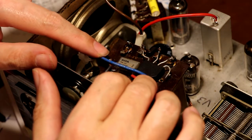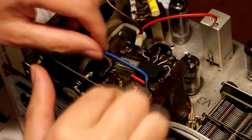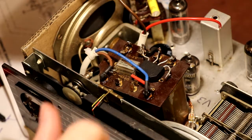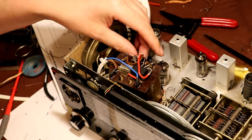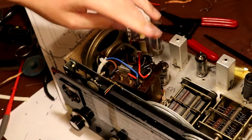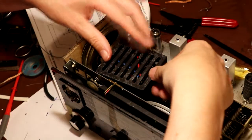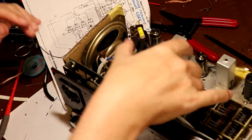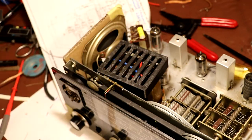I also thought we were getting a hint of modulation hum and maybe RF instability. This radio would have had an RF bypass capacitor fitted across the main supply - well it didn't when we got to it, but I've fitted one of these X-rated safety capacitors, so that's got one installed now. It probably won't make any difference but it's shown on the diagram so we've put one in. It's a bit of a rat's nest in here. I was also getting a little bit bored with shocking myself on the top of this transformer, so we've just gone ahead and 3D printed a cover which should just clip onto here. It's got a little notch cut out of one side just to let the pulley wheel go through. So now when I touch the top of this transformer, hopefully I won't get a shock.